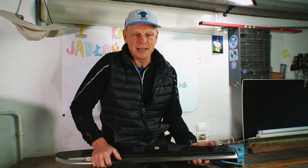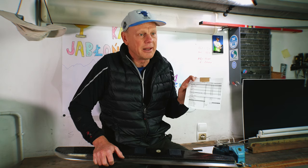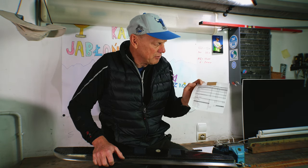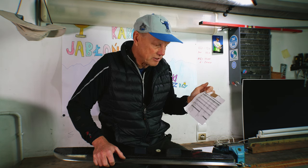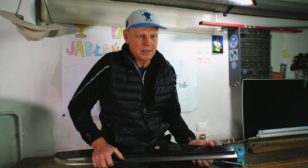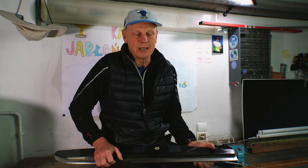So once you finish sharpening your runners, it is important to make notes and try to learn which runner has how much crown and what the angle of the edge is. I have here a small list, and this list contains all the runners I have, with different lengths of crown, which I have had in my repertoire for 25, 30 years. So that's maybe too many. But it doesn't matter if you are a beginner, or you have fewer runners or more runners, or you are more advanced. Important is that you know what kind of runner you're going to use and how much crown it has.